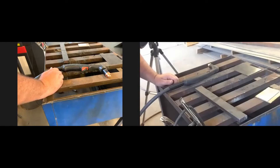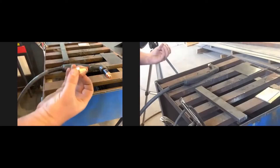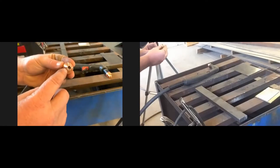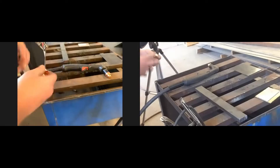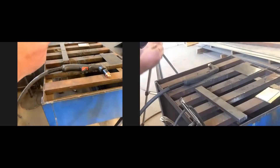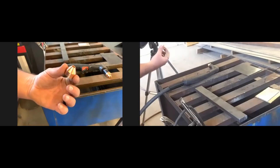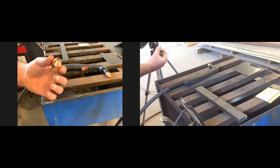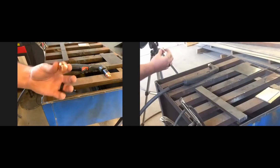For precise designs, that's where the CNC machine comes in — it ensures accuracy. On CNC machines we use mechanized shields instead. Mechanized shields have a bigger opening and no notches since you don't drag them — the CNC machine maintains a set height above the metal. The notches on drag shields allow sparks to exit downward rather than back into the gun. On CNC machines, everything is computer-controlled so we don't need drag tips — we want the mechanized shields.